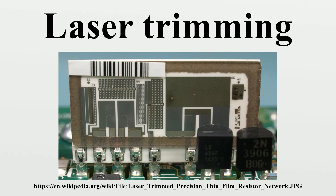A similar approach can be used to program digital logic circuits. In this case, fuses are blown by the laser, enabling or disabling various logic circuits. An example of this is the IBM POWER4 microprocessor, where the chip contains five banks of cache memory but only requires four banks for full operation. During testing, each cache bank is exercised. If a defect is found in one bank, that bank can be disabled by blowing its programming fuse.